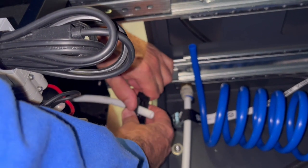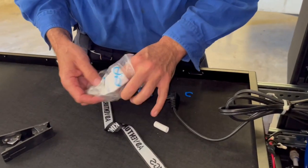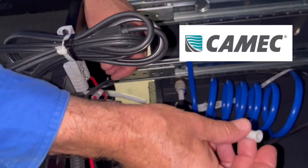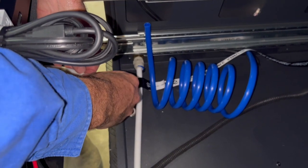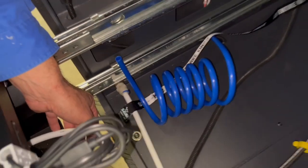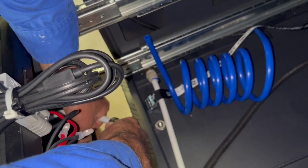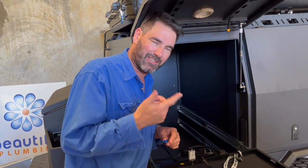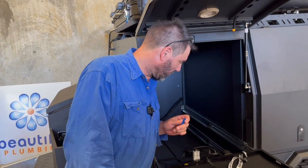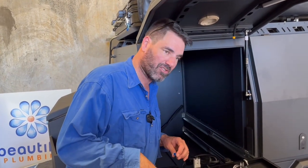So what I'll do is, with my cutters here, I'll just cut the end of this pipe off. Now I might put one of these John Guest sleeves in as well — you can buy these from Kamek. That's what we use all the time, so it doesn't let the pipe collapse. But that's really loose inside there, so I don't even know if that other one will fit. I'll try and force my John Guest fitting on there. I've just tried to push the white stuff into the John Guest — it's not working, it's leaking. Turned the pump on and we tried to give it a pull and it started leaking. So we've got to maybe just replace the blue pipe, remove that white pipe altogether and just leave it all in John Guest — then we know it's not going to have any issues. So we'll just try that now.